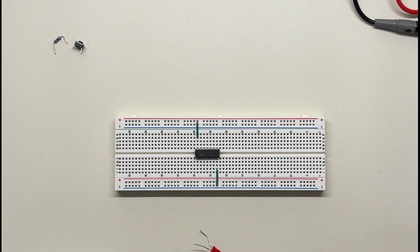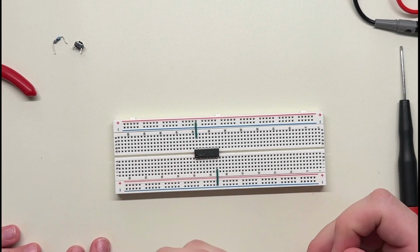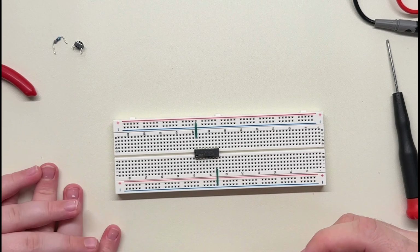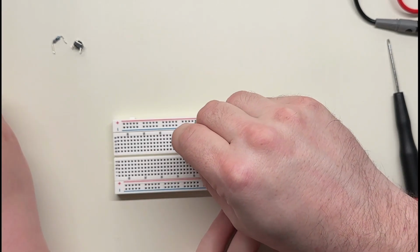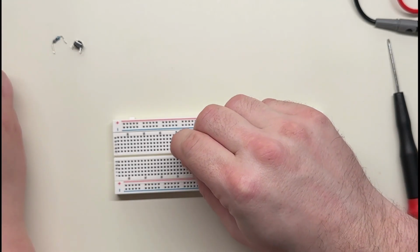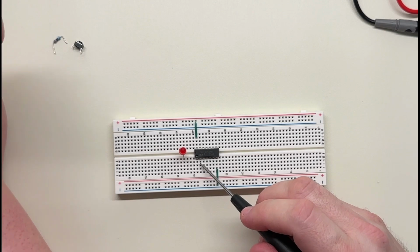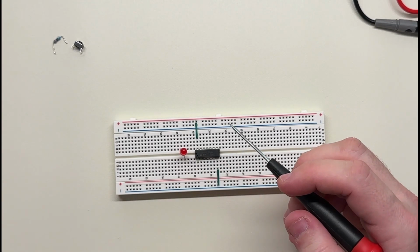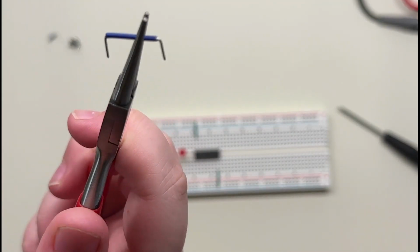So we know from the pinout that this is an input and this is an output for the first gate. So we want positive to be true, right? That's usually the case anyway, as far as I know. So that means that there will be positive on this when we want this to light up. I think what that means is we need to make a little bit of a jumper situation. The longer one is positive. That's the anode. And I'm just going to put this here. And so then what we need is a jumper from here to the output of the first gate. So that shouldn't be a long one. Not too long, nope. I think we can get away with one of these. Yellow or a blue maybe? But this is what I'm talking about.